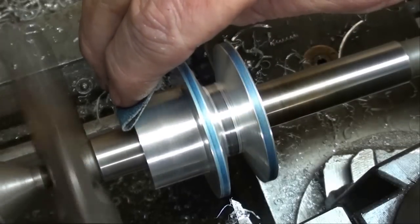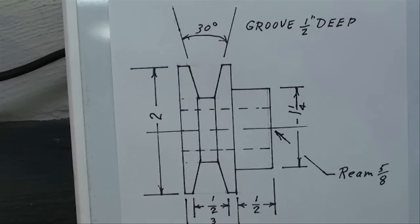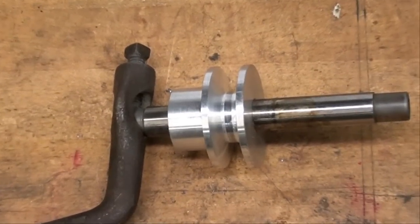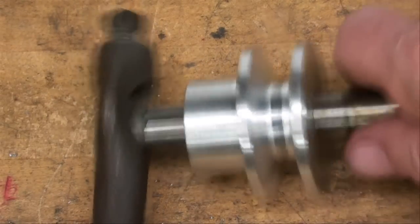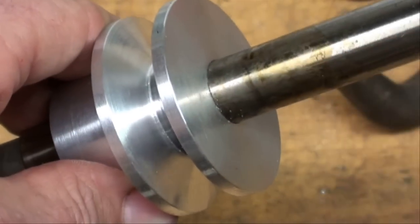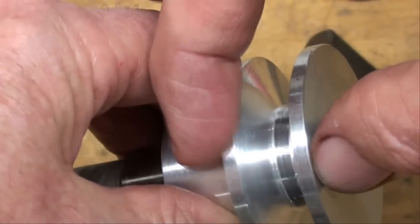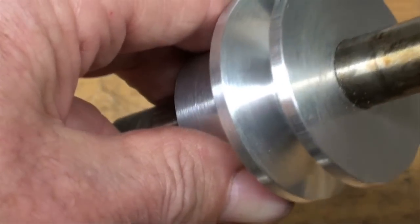When you get down near the dog, be very careful. There's the print again and I think I'm pretty close to all the dimensions on the print except that one that I changed. There's the work — see the V-groove? I'll take the dog off now. If you want to do any facing while it's on the arbor, you can face across here, but make sure you don't hit the hardened arbor or you'll damage it or dull the tool. To face a little off if it's too thick, wrap one layer of masking tape around here and when your tool catches the tape you're within about two thousandths — that's close enough.